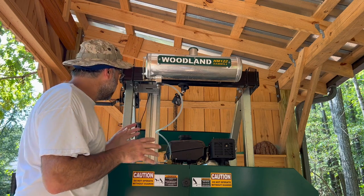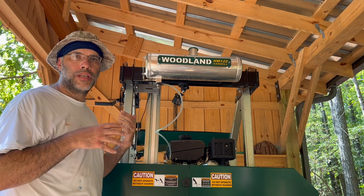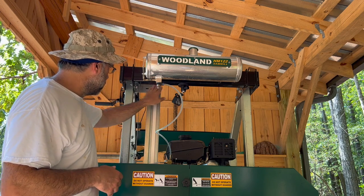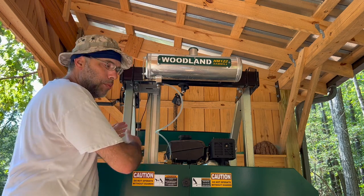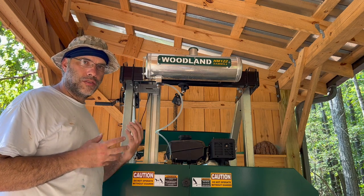So to me, that's a key step no matter how you do this mounting. Just let it relax into position, check it. You wanna make sure that the slide and the motion of the sending unit along the slide is very closely parallel to your up and down motion of the sawmill, so nothing sticks or binds as you use this.